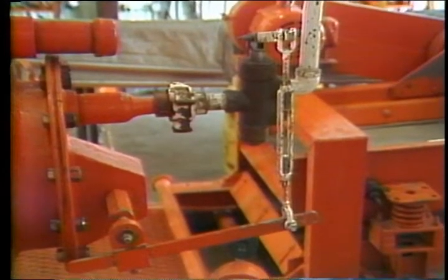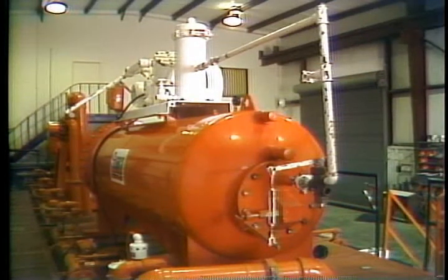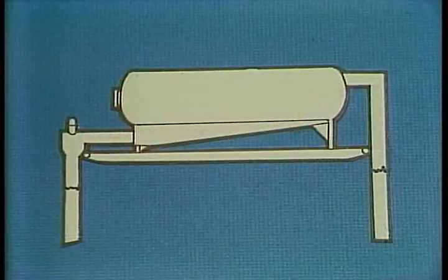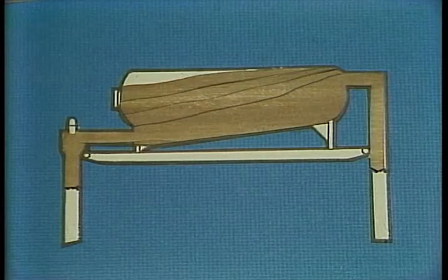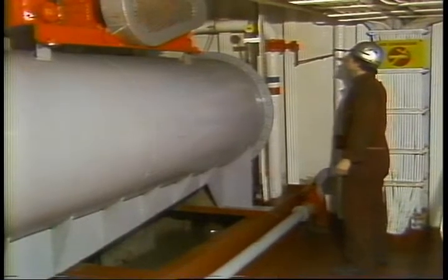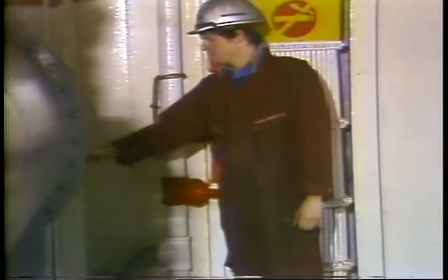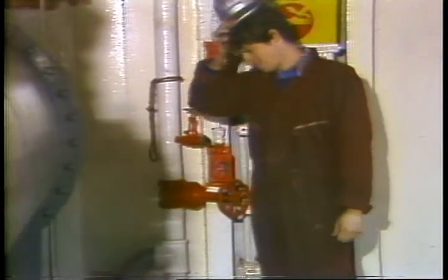When you see some movement, open the valve in the mud line so that the jet nozzle pulls the fluid out. Never open this valve until positive indication is gained that there's actually fluid in the vessel — if the suction and discharge pipe were plugged and the jet was turned on, it would fill with fluid and rupture. After you've confirmed there's fluid in the vessel, adjust the mud flow to the discharge jet nozzle to pull at least as much mud through the degasser as is being circulated. That should be all the adjustments you'll need to make.